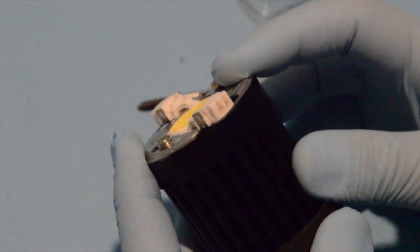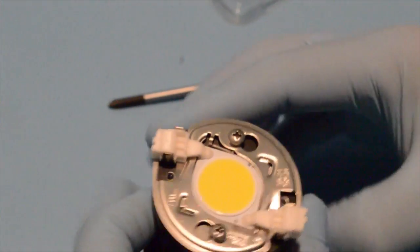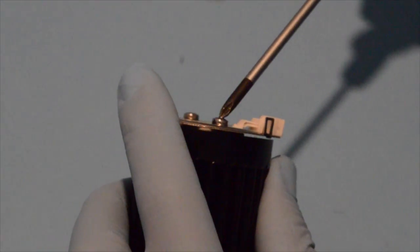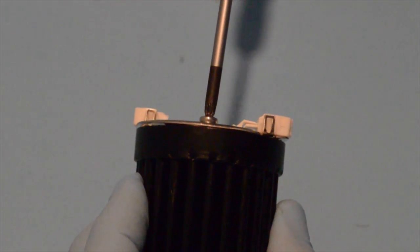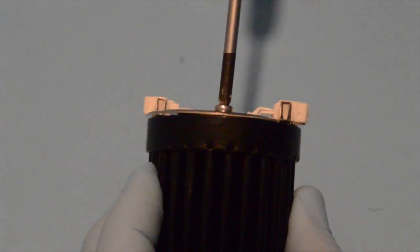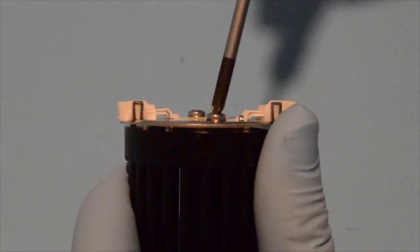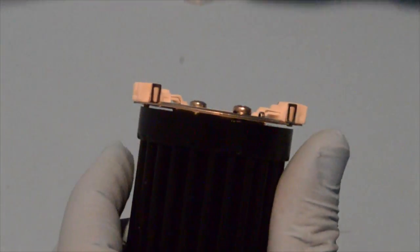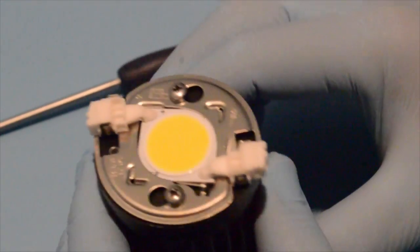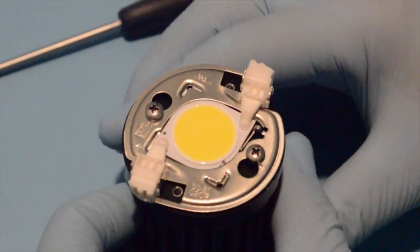And having done that, I want to take a look and make sure there's no misalignments, make sure everything is fitted well. And then at that point, I'll go ahead and torque these down. You want to torque it down so that you're just making contact, or about a half millimeter off the surface of the heatsink. Now the official torque ratings are offered by Ideal. If you have a torque wrench, those numbers would be 2.5 to 4.5 inch-pounds or 0.3 to 0.5 Newton meters.